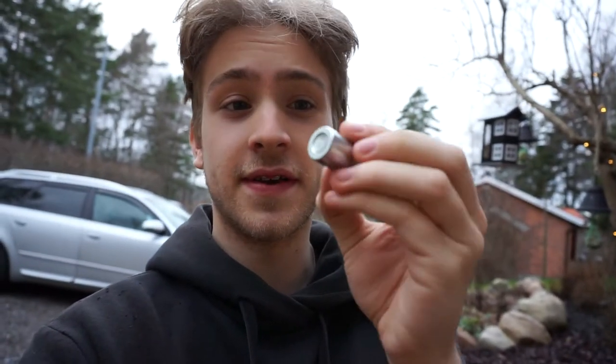So where we left off last time it got dark and it started raining, and we also didn't have anything more to do. Now yesterday I received these sleeves that we're going to insert right here into the cage — we're just going to weld them in there and then we're going to have our third mounting point for the seat belt.